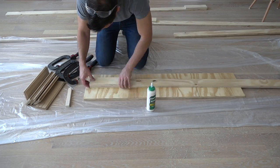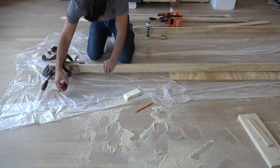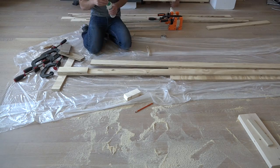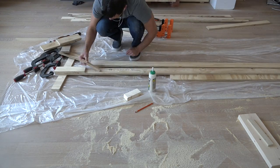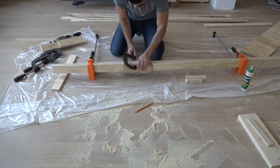The bottom shelf is the easier one to make — it's just two layers of three-quarter inch thick plywood glued together. I used waterproof wood glue for this one since it is going to be in the bathroom and will be exposed to moisture.